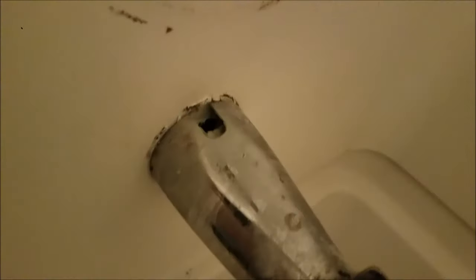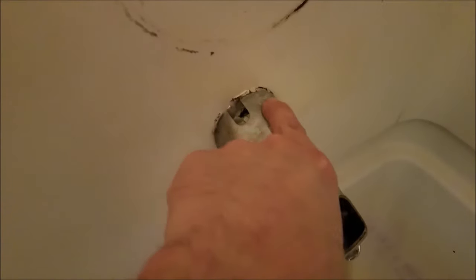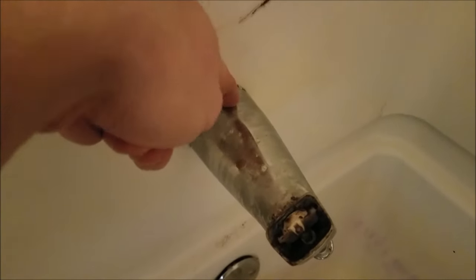So what I think has actually happened — and it's probably going to be impossible to pick up on the camera — is this sleeve inside of here has shifted. So the set screw is in fact in here but now it's right around this position. What I am proposing to do is take a drill and drill a small hole here, wind it out with a bigger drill bit in hopes that I can get an Allen key in there to loosen it up and finally pop this off.